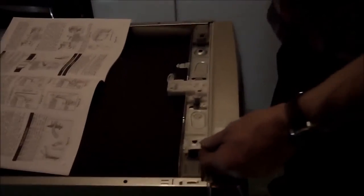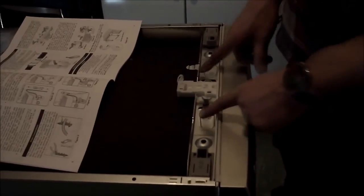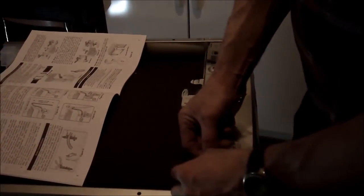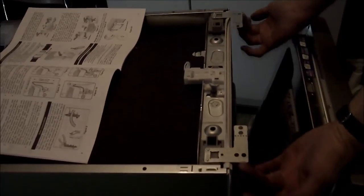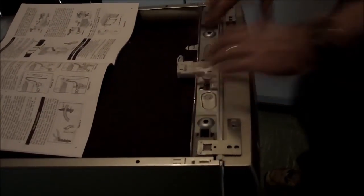This installation here shows an optional installation of brackets, whereas the other one had two tabs that came out right like that. These are optional tabs that mount like that. Okay, so that goes under the cabinet, and then when the door opens, you can gain access to those openings, those holes, to dial in your position once your machine is in the right final position. This here is our old clamp from our old dishwasher where we had the riser curve on the hose.